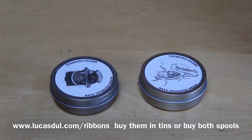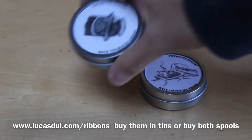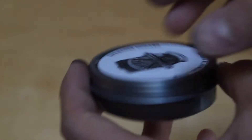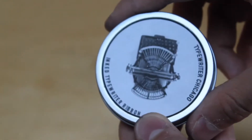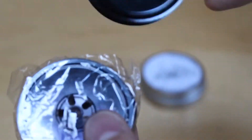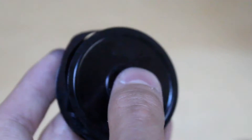After that is done, you will need to get yourself a brand new inked ribbon. In the old days, typewriter ribbons came in airtight metal ribbon tins that were designed to both protect the ribbon and to keep it fresh. Inside you will find one singular metal spool, and that is why you remove the ribbon from the other spool. Once the new ribbon is removed from its packaging, you will have to stick it into the post of the other spool — the empty take-up — and spear it on one of those sharp little posts. It will stick on itself, and at that point just wind it on like normal. Then you have a double-spooled ribbon.